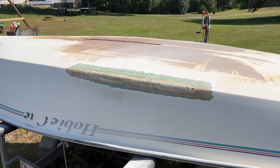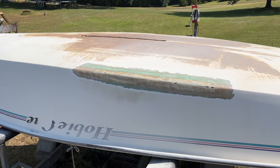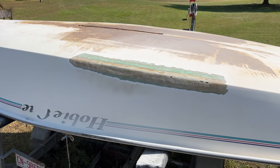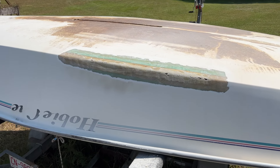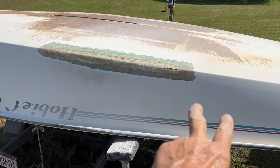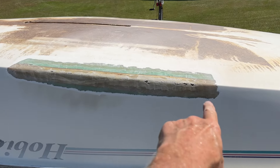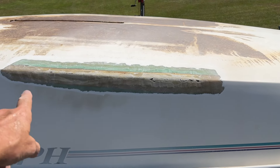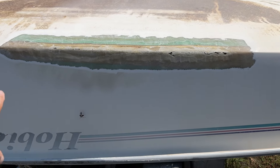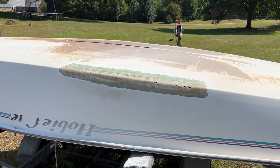It's really hot - 95, 96 degrees and I'm right out in the hot sunshine. I want to at least get one layer across it before I quit, just to kind of tie it all back together. It was a little bit worse than I thought - at first it almost looked like I could just fix it with some thickened gel coat, but the more I dug into it, the more I realized the layers of cloth had separated and the bond had been broken. Whenever it's like that, you've got to grind it back - you don't have a choice. I'm back to good solid glass on the ends for about four or five inches on either end.